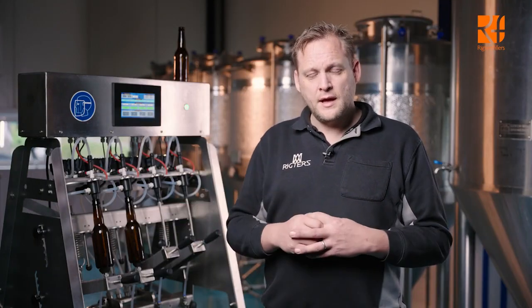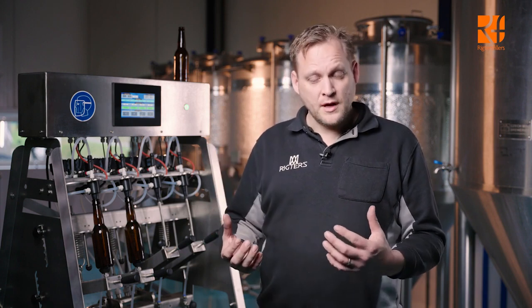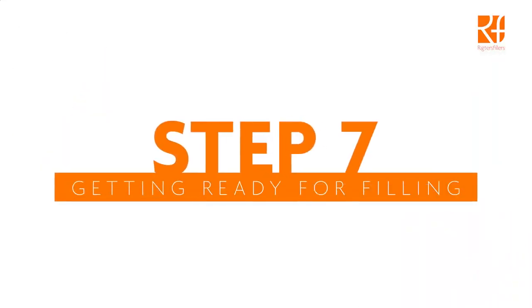After 15 minutes, you take off all the bottles, clean them out, and fill the bucket again with hot water. Repeat all the steps just with hot water to rinse out all the cleaning solution. After you have cleaned it, the machine is ready to use, or you can choose to use a second cleaning solution like Star San. With the Star San or Sani Clean, repeat the steps and end with the Star San fluid still in the machine. Now your machine is ready to be used.